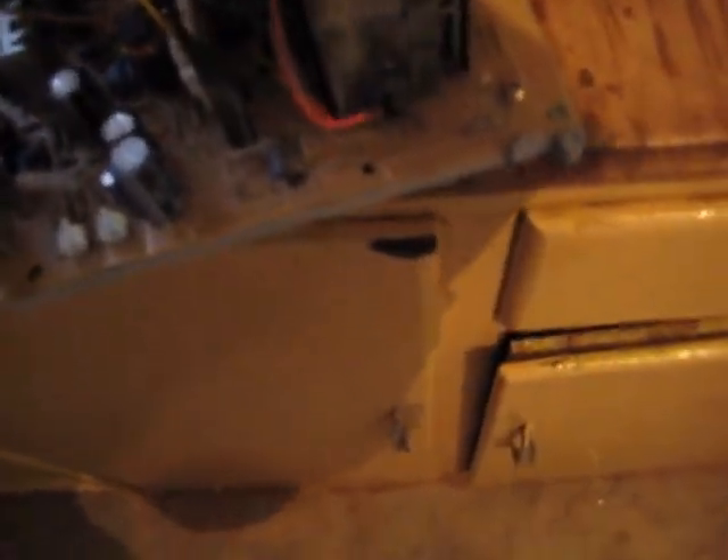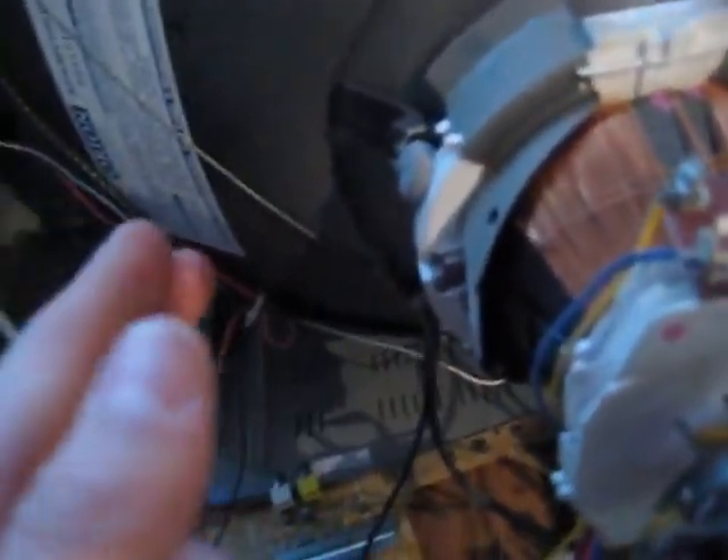The shut off goes bad. But if the vertical goes bad as well, then there will just be a line on the screen. But this one doesn't do that — it shuts off altogether. That's a safety feature. So I'll start off by using just the vertical scanning coils. We'll just use that as a first example.